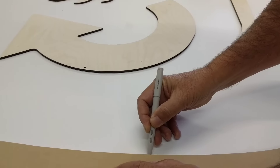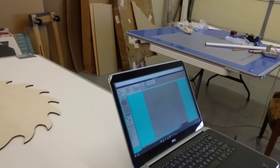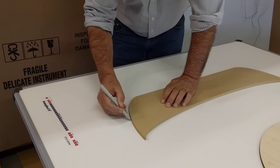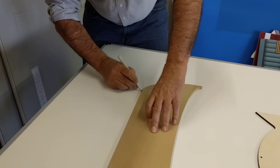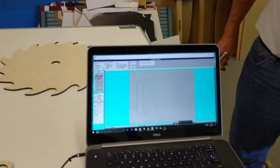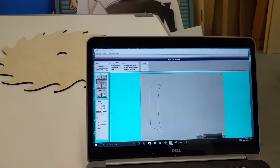I digitize all the way around the edge of the part — you can see on the screen how it's done. I continue at the bottom, come around holding the tip along the edge, all the way back up to the top, then digitize the top part and go all the way around. When I'm finished, I click done. It asks if I want to connect the first and last point — I say yes — and there I have that part.